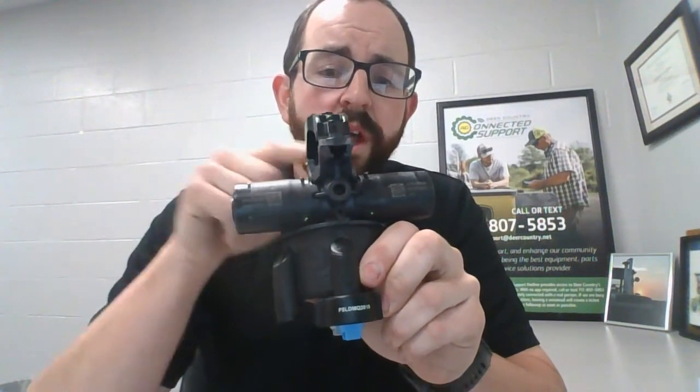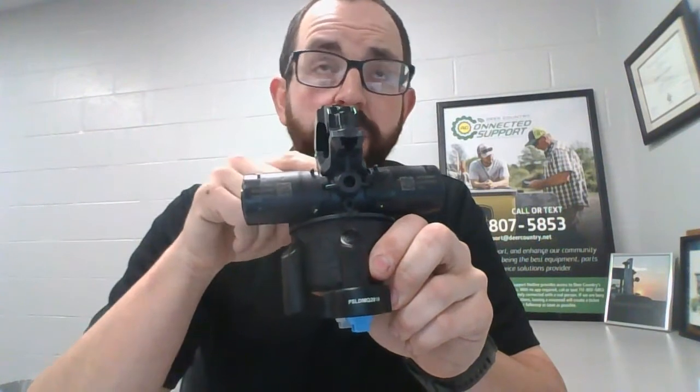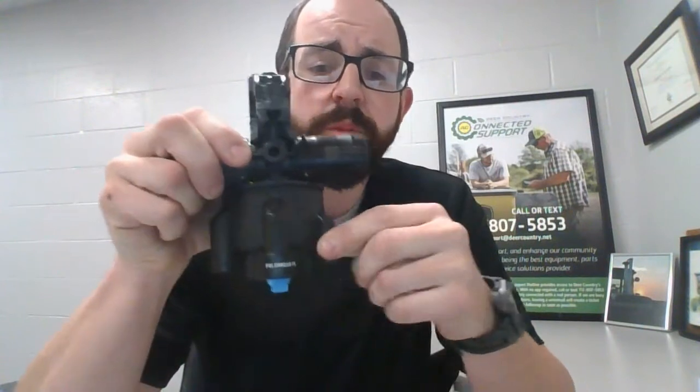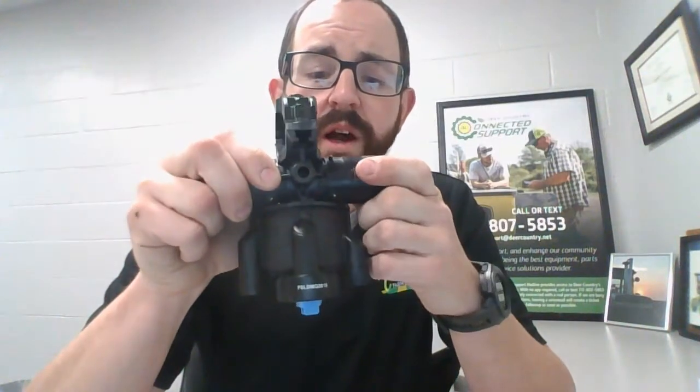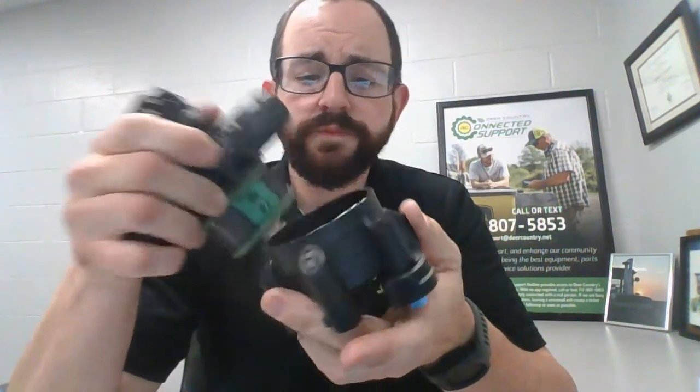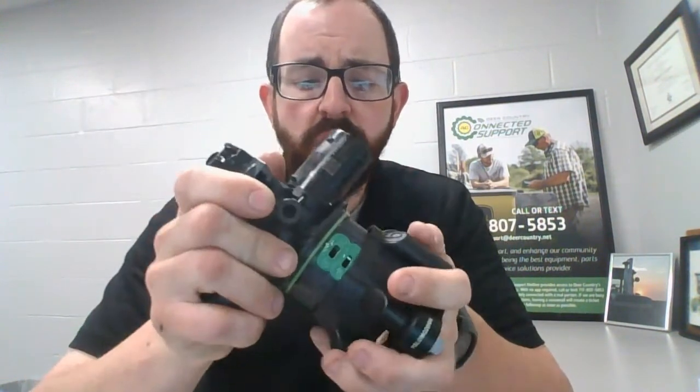In this mode with nozzles 4–6 in front, you get 1.5 gallons per minute from each solenoid — 3 gallons per minute total — with 15 Hz pulsing from both, so 30 Hz pulsing out of one single nozzle. In the virtual screen, it automatically goes to A and B combined. This is for higher rates — when you want to side dress or put down 40–50 gallons — putting all the flow from both solenoids through both holes into one single nozzle.